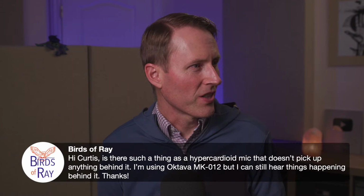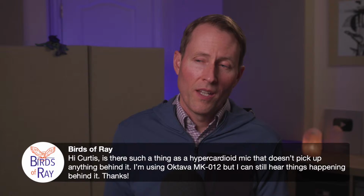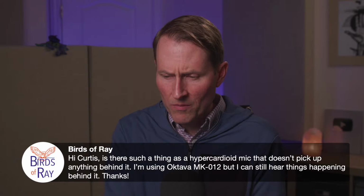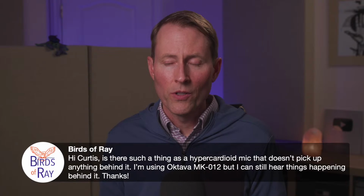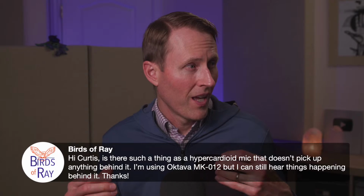Is there such a thing as a hypercardioid mic that doesn't pick up anything behind it? I'm using an Octava MK012, but I can still hear things happening behind it. Well, one company that does some very interesting things with microphones and polar patterns is Sanken. I don't remember the exact model number, but they do have a shotgun-style microphone that I believe uses two or three capsules in it. And it actually uses one of the capsules to detect what's coming in behind the mic and attenuate that signal. So if you're looking for something that really focuses what you are picking up and ensures that you're not picking up much from behind, that would be something worth looking at. Now, I haven't used that in practical situations yet, and I don't know what it does overall to the sound.